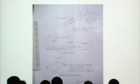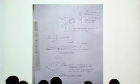It's a funny phenomenon, but our problem was not the glass being stressed, by the way. We'd already worked out the glass stress could cope with this deflection. The worry was that the edge would become so curved that the insulated glass unit would actually fail, because it got too curved. And so anyway, we convinced ourselves that this would remain almost straight when you pushed it down.